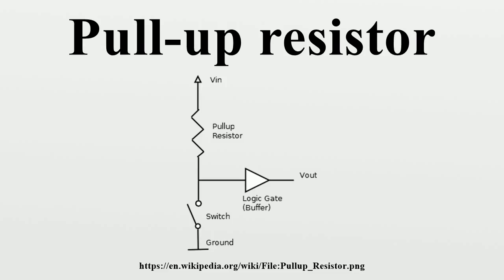A pull-up resistor may be used when interfacing logic gates to inputs. For example, an input signal may be pulled by a resistor, then a switch or jumper strap can be used to connect that input to ground. This can be used for configuration information, to select options, or for troubleshooting of a device.